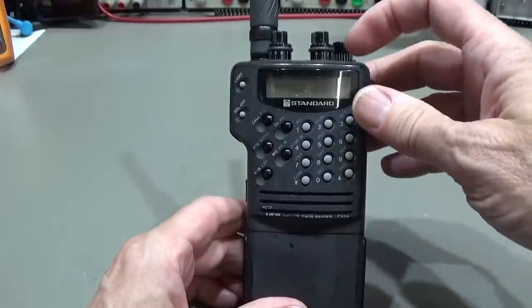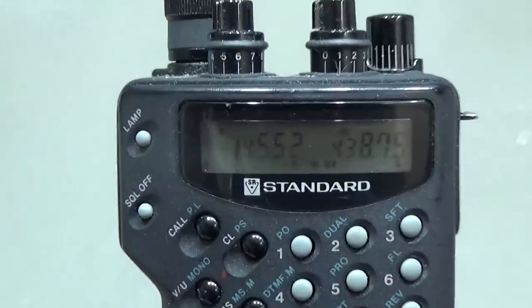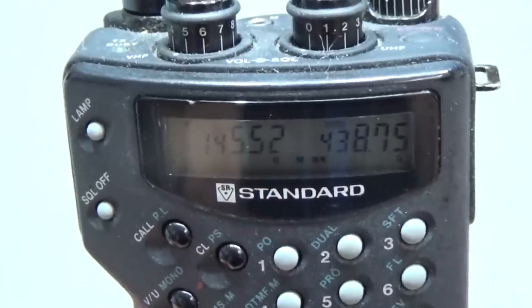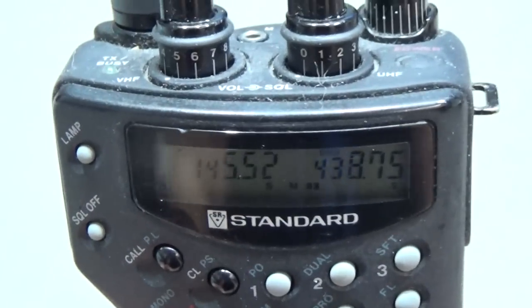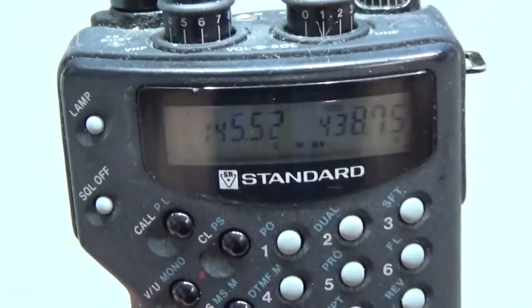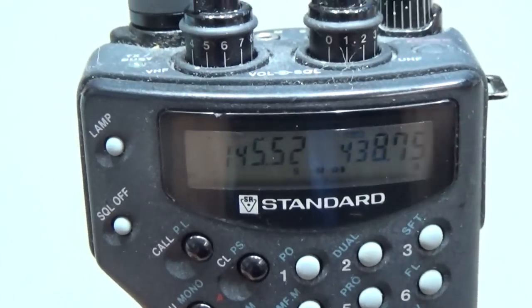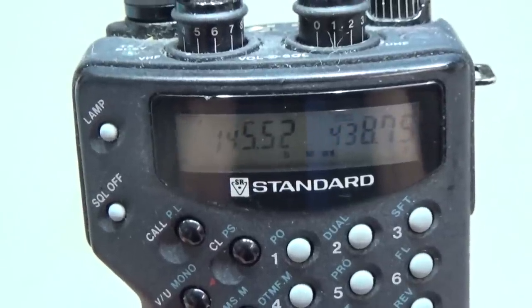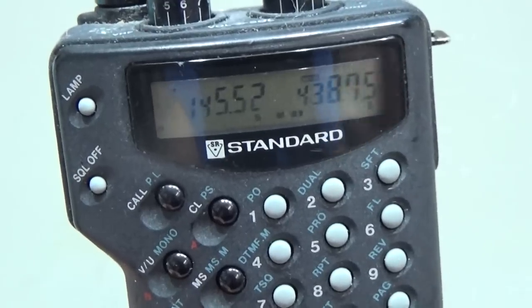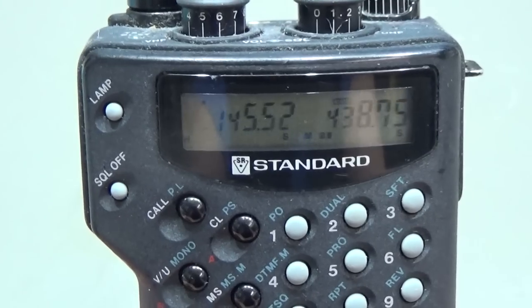And well, what I can tell you, so we do not see our blinking anymore, simply because I had the radio run after checking it when it came in, and it was at the power supply for several hours, and the blinking and flashing of our display is gone. So this flashing was indicating, or generally is indicating, that the PLL is in an unlock condition. And what I've seen else is that the radio was consuming a lot of current. And that all was already showing that there is basically a leakage.